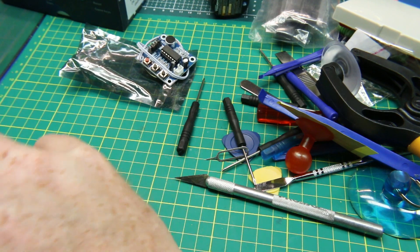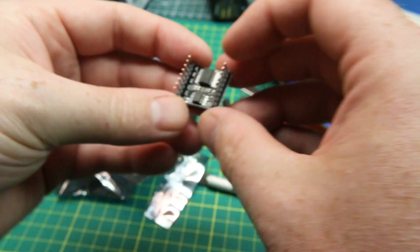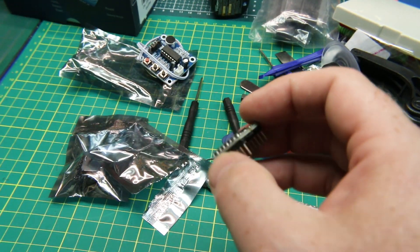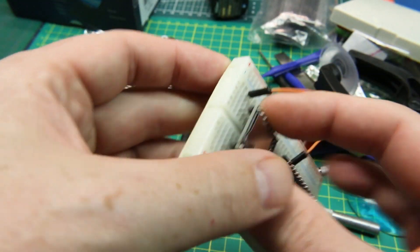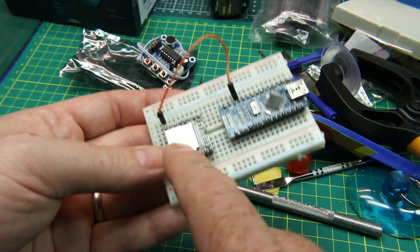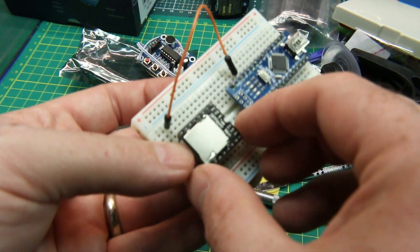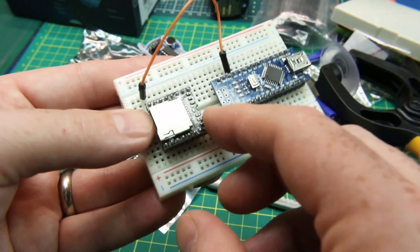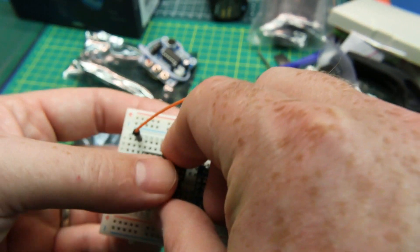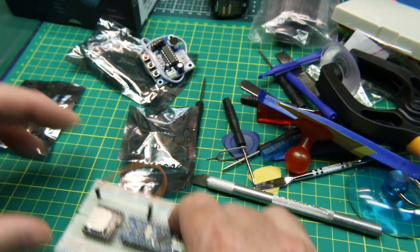Along those lines, I believe this is similar — yes, these are actually MP3 players. That is an MP3 player on a chip solution, breadboard friendly by the looks of it. It should line up to any breadboard and takes a micro SD card. We can use a microcontroller to tell this to play back whatever track from the card, which is really handy when you want different sound effects from a robot or a user interface with specific sounds. I'm pretty sure there's an amplifier chip on there too, so you might be able to hook this direct to a speaker. I'll check the specs — maybe this winter we'll make some time and have a play with those.